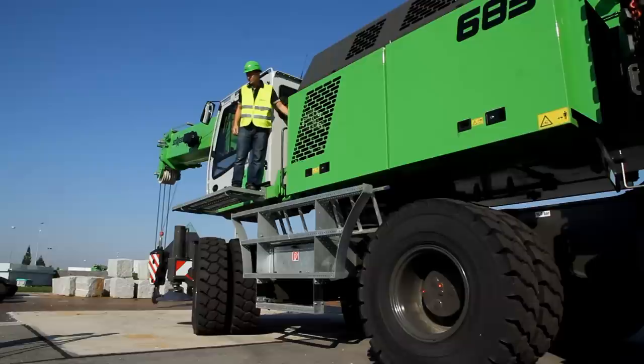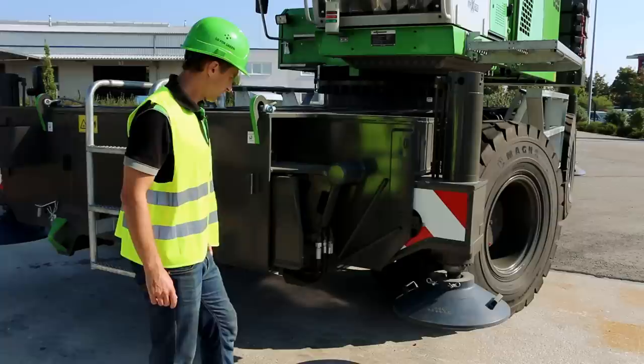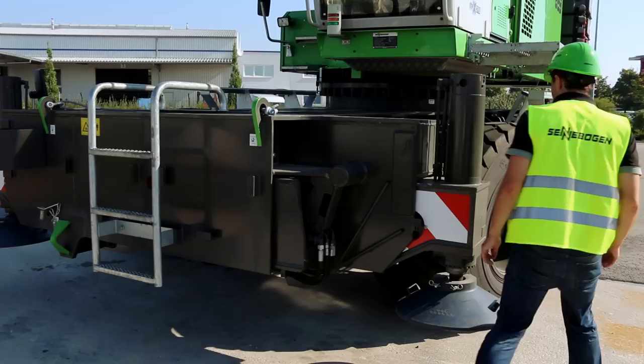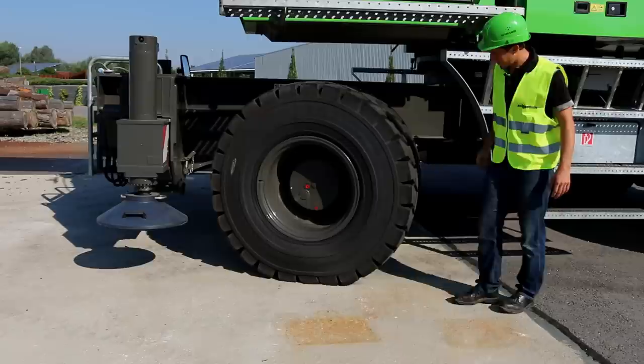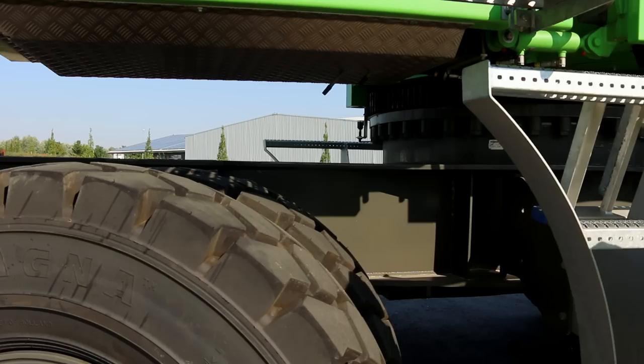When exiting the cab, I check the level of the windshield washer fluid. I make sure the hydraulic lines near the outrigger are secure. I also make sure the lubrication points are being serviced. The outrigger pad should be pinned. There should be no leaks in the hydraulic cylinders and the pipework should move freely. I then check the tyres for damage and check the tyre pressure, adding air as needed to meet specifications. Also make sure the lug nuts are tight.